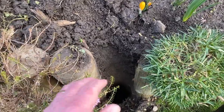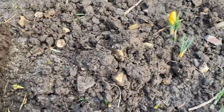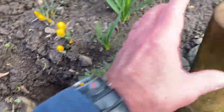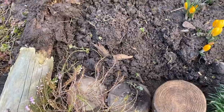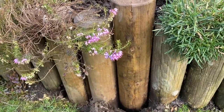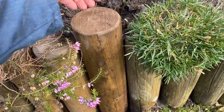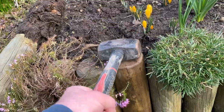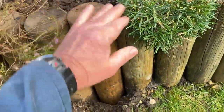It was worth getting my gloves on and digging down and prizing out — I got quite a bit of soil and stone out from the bottom, which needs to be completely clear. You want a nice clean hole so that the post can slide all the way to the bottom, ending up at the same level as it was before. You don't want the post sticking up. It will only just require a gentle tap down — just make sure you've got the black-treated section at the back before you knock it in.